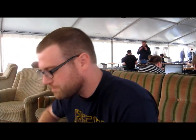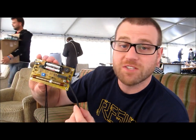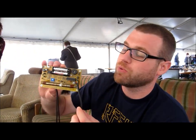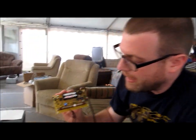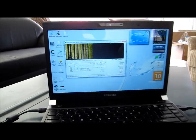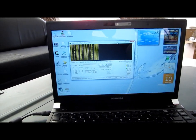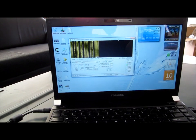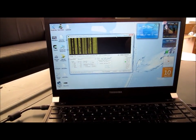The other thing you can do is it has a serial port. You can use this serial cable to connect to the serial port for data logging. This is an FTDI USB to serial cable, which works at 3.3 volts. And you can see that over on the laptop here, now it's recording radiation — showing the measured counts per second, counts per minute, and an equivalent dose in microsieverts per hour.